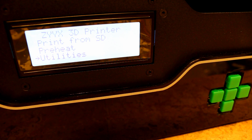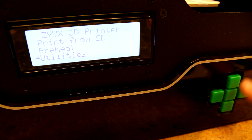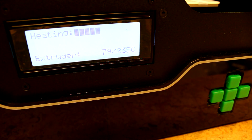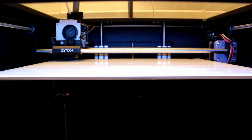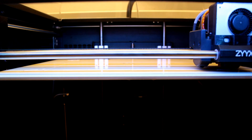If all the disks look worse than the pictures — plus 0.200 mm or minus 0.200 mm — we suggest redoing a probe calibration. Once all the offsets have been set, we suggest printing another disk print, the file called zyx-testprint-quick.x3g, to verify the tuning. You might feel that you want to do some final adjustments. Note that even after the fine tuning, there will be a slight difference between the disks, but these differences won't affect the printing quality. Once the fine tuning is complete, the factory recalibration of the Zyx 3D printer is finished.